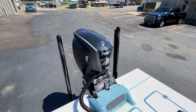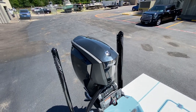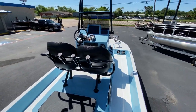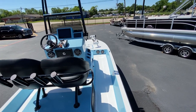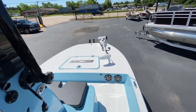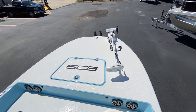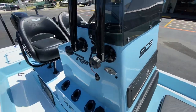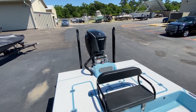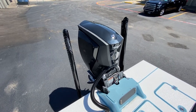This top cap pops off and holds a little over two gallons of oil. At the Miami show last year in my previous 24, I didn't top off the oil the entire time — not until we left for the Keys for a photo shoot. Very oil efficient, even though it's a two-stroke. Everyone thinks two-strokes aren't oil efficient, but this one is. It's also a direct injection engine and the cleanest outboard on the market, which makes it the most fuel efficient as well.